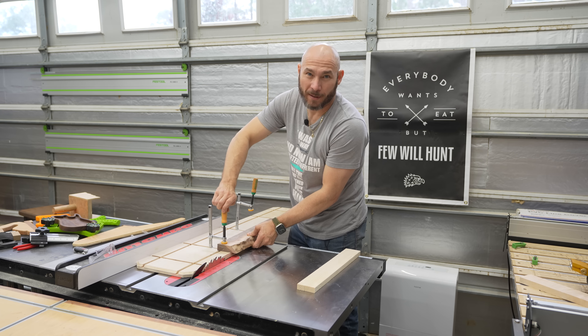One thing you could do if you wanted to make this super accurate — not really rely on the fence at all — is put a miter bar or a piece of wood in the miter slot. I found I like using the fence as a guide because it makes it fast and simple. On thinner pieces, make sure your clamp is not going to contact the blade — just keep an eye on that. If you joint shorter boards or have a job site saw, I'd really recommend the three-footer. Making the three-footer is the exact same process as the four-footer.